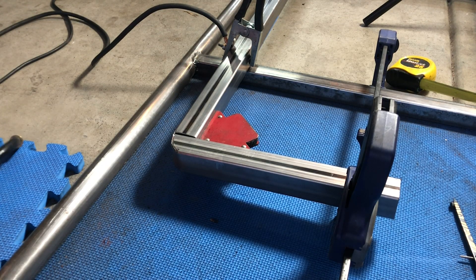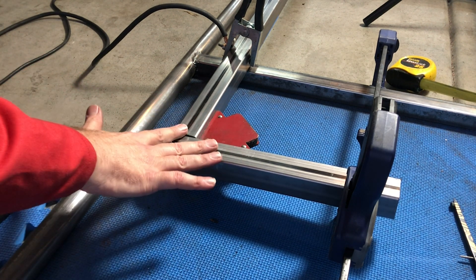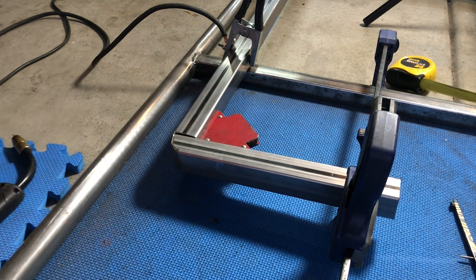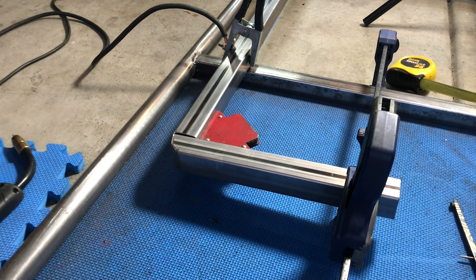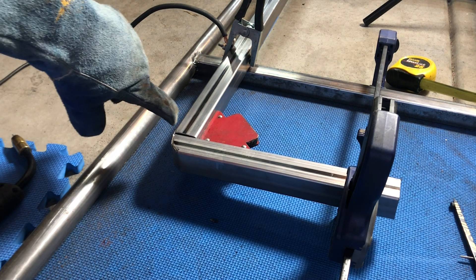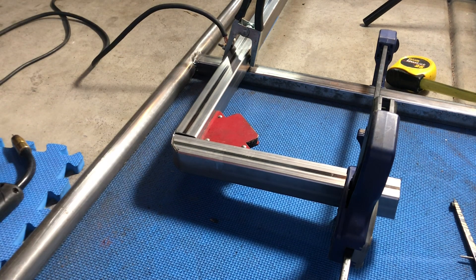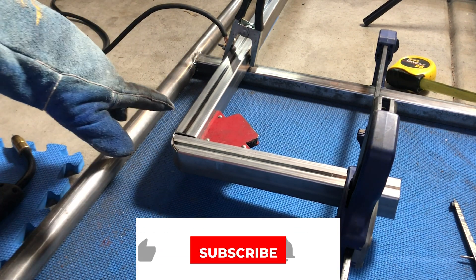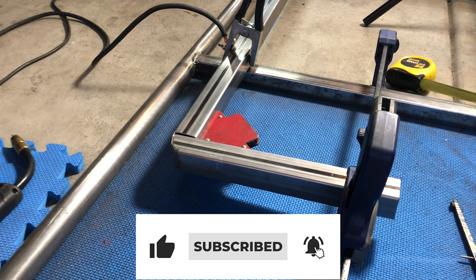As you can see, I've got a little bit of cheating to do with the welds. This thing is all clamped together, it's square and it's level, and it's all going to be good, but I'm going to have to do some filling in to make my weld convincing. The whole strength of the whole system is not going to rely on this one corner — there's going to be cross beams and other stuff in there, so I'm not super worried about structural integrity, but I would like it to be beautiful.